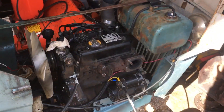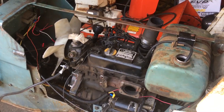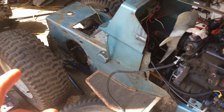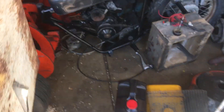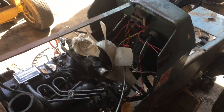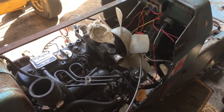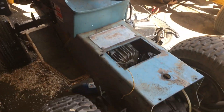I don't want to run it too long — it's a nice Sunday afternoon, let the neighbors enjoy their time outside — but I got it running, which is good. The power steering works. I did not put the transit gear in yet, not quite ready to drive it. I just wanted to make sure it's going to run. All I have left to do is find a pipe plug for this hole, finish up some loose ends in the wiring, get some radiator hoses to get that plumbed, and figure out the air intake and exhaust. But it's getting somewhere — it's really coming along.